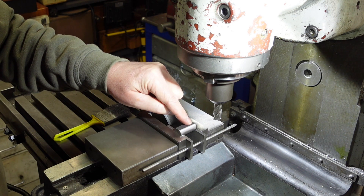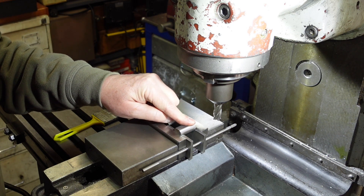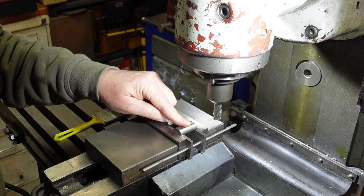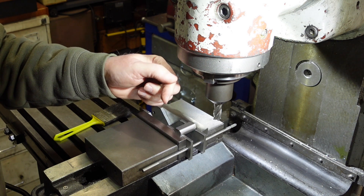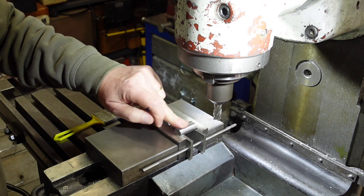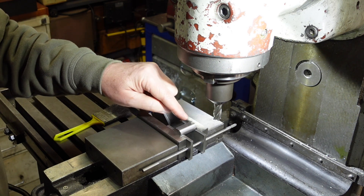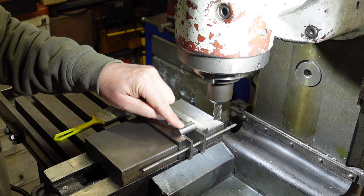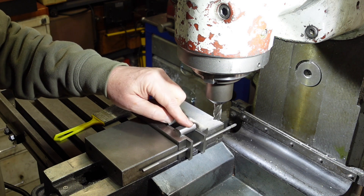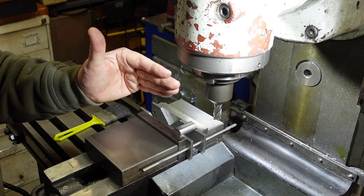So I'm making up a plug. I've turned a round piece of material out of a bit of 16mm bar - hot rolled steel has generally got a couple of flat sides on it so you have to be careful - but I've got the flat here that I've then milled off. I'm using my notched parallels, and what I'll do is just clean up the edges here so it'll sit nicely on a couple of normal parallels, put that in, take off the other side, and I'll have a plug gauge.